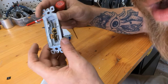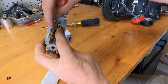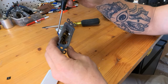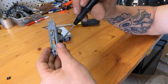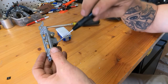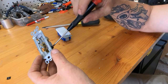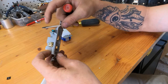That's pretty much it. There is no on or off state - you're just basically sending power on one path this way, or you're sending power on one path this way. That's what that common screw is, because both of these paths are contingent on touching this one screw - the black common screw. So on a three-way, on your hot side where your incoming power is, your hot is going to attach to that screw. And on the other side, on your leg side, this screw is going to be what your switch leg gets hooked up to.